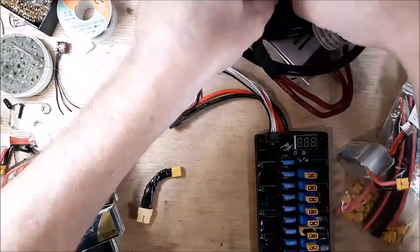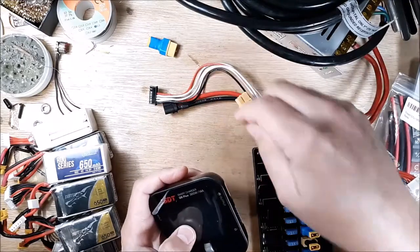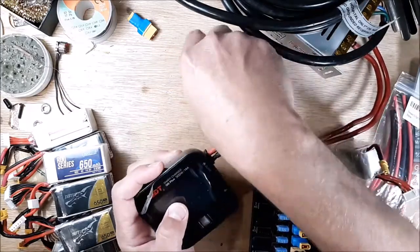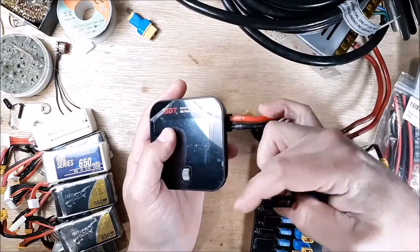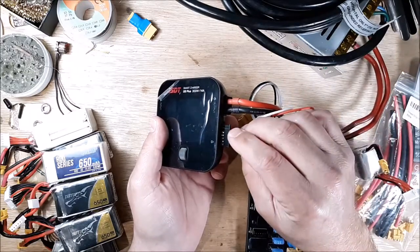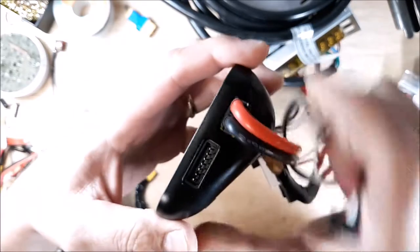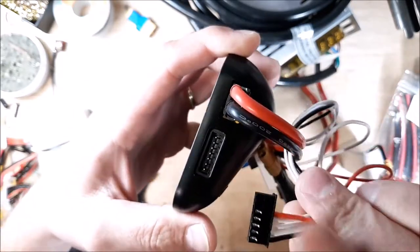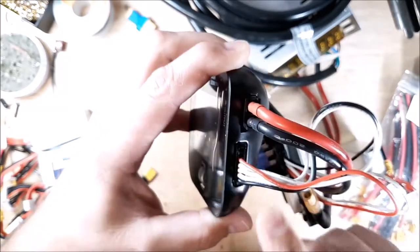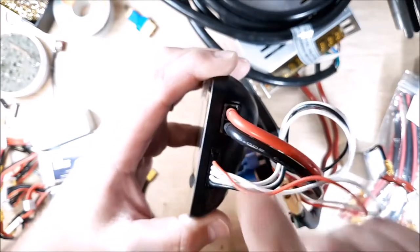Connecting the board to the ISDT Q6 charger — this is about $50, the board was about $30. You plug in the XT60, making sure your ground is oriented correctly, then plug in the balance lead. The design is smart because it has a 6-pin connector, so you don't have to worry about bending individual pins. On your charger there are 7 pins — a ground and 6 hot leads — and the board covers all of them at once, so you don't risk folding a pin back.